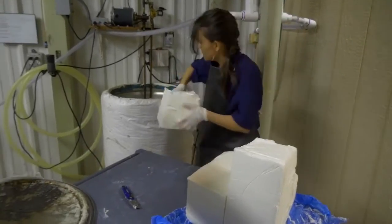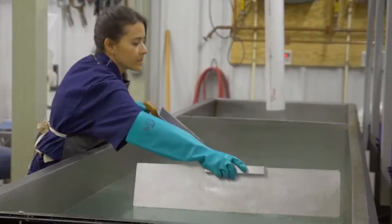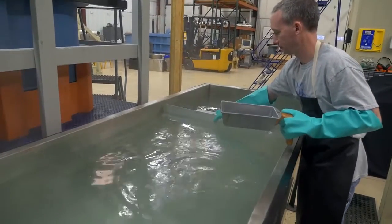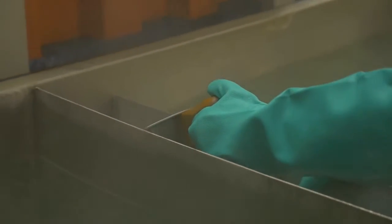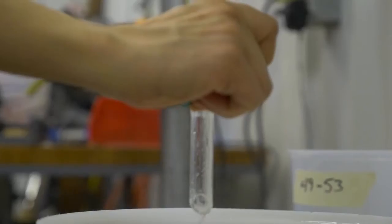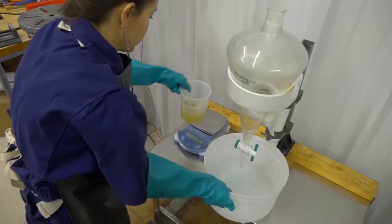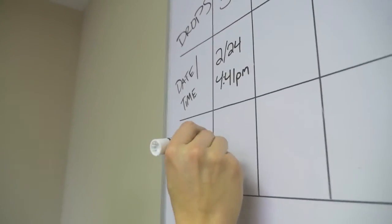During the test, all the water and a small amount of grease passes through the unit and goes into the skim tank. In order to determine what is retained in the unit, we have to determine what is not retained. That's where skimming comes into play. The lower specific gravity grease rises to the top of the skim tank. We use a long blade to corral any grease that has risen to the top over to a corner, then use a small pan to remove that material. We pour that material into a separatory funnel where it further separates — getting a little more water out — then pour it into a beaker and weigh it. That gives us a weight for each drop cycle of the grease that passes through the unit. That tells us what it didn't hold, and since we know what we put in, the difference gives us the amount of material held inside the unit.